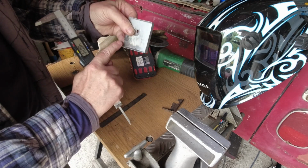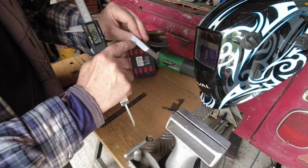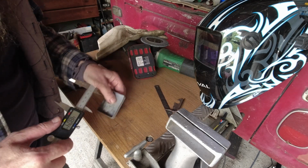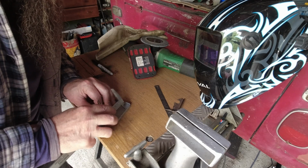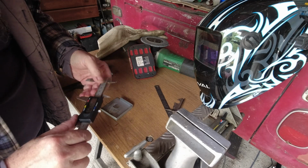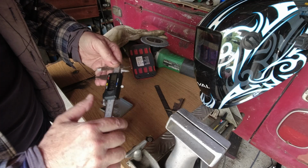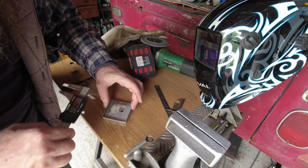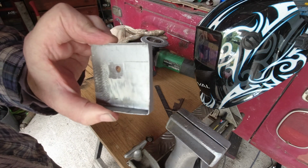So the bottom is already trimmed and the sides. There's quite a little bit. This gets chamfered off across like this. That's how it's finished from day one in the factory. Scribe there. It's easy enough to scribe it because it's painted. And now we need 14 mil from the inside again. Hope you can see that. The scribe line.